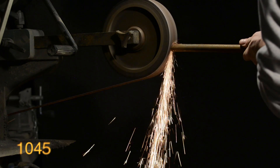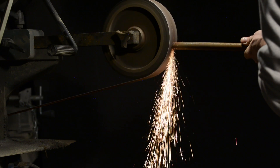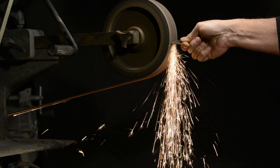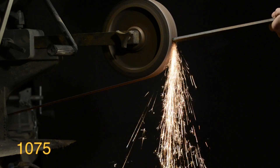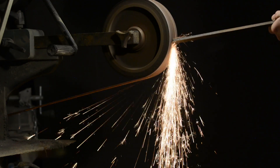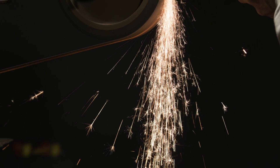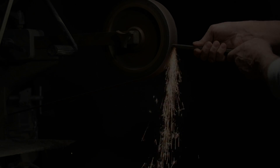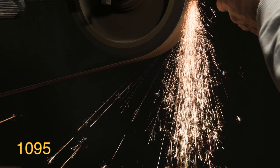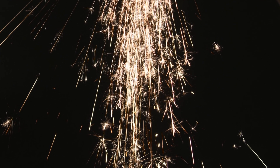This right here is 1045, which is just on the edge of hardenability. Anything underneath that, you can't make a knife from — and frankly, this is not ideal knife steel. 1050 is a medium carbon steel that's just hardenable in water. Now we're increasing the carbon going up to 1075, then 1085. Now 1084, which also has a higher manganese content than these other ones. Then on to 1095. As the numbers go up, the carbon content goes up, and you'll notice the sparks tend to run shorter and break apart into these little dandelion configurations quicker, giving it the effect of being brighter.